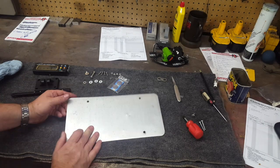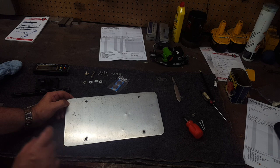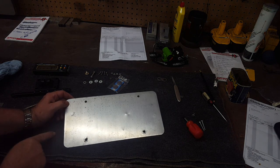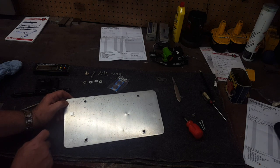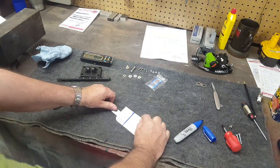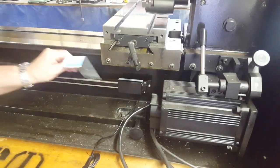Here's the material I'm going to use to make a little custom mounting bracket to go from the back of the moving sensor up to the pre-drilled and tapped screw hole in the bottom of the cross-slide table on the Smithy. I'll go over to the cutter, whack this piece off, take some measurements, then go to the brake and make a bend — just a test piece to see how it fits.